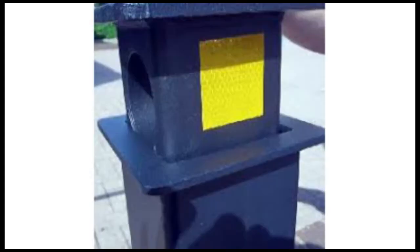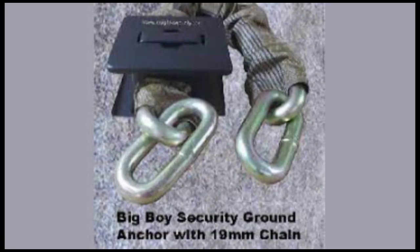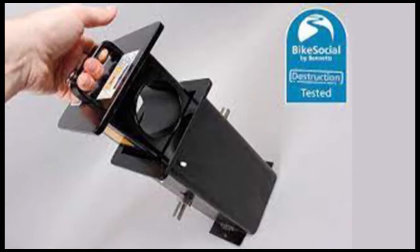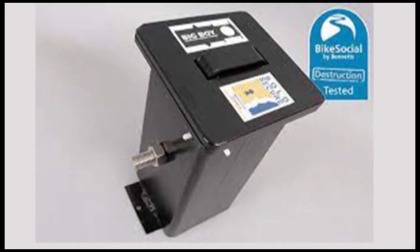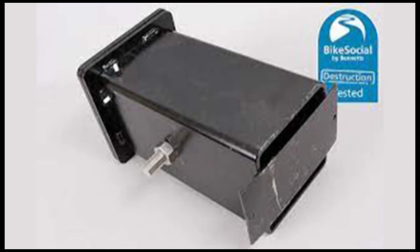The bottom section that sits in the concrete is 4.9 mm with a 6.2 mm tall plate. Basically, it's very solid. The telescopic section is retained with an M16 threaded rod that sits 112 mm below ground level, so there's no way of attacking it. The chain passes through a 70 mm diameter tube with a 3.6 mm wall thickness that's 100 mm long, large enough to take a chain with up to 19 mm links.